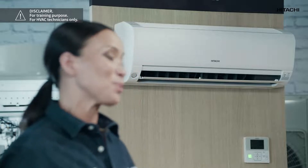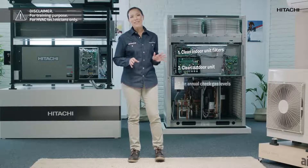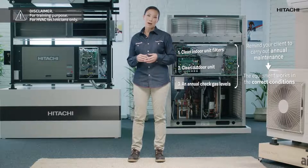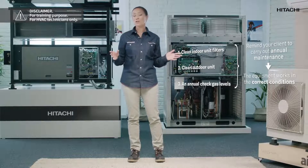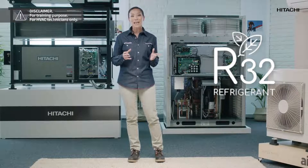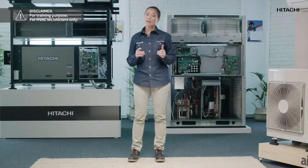Before we finish let me remind you that the maintenance of R32 equipment is very important. It doesn't differ much from what was required before. It is necessary to periodically clean the indoor unit filters to remove impurities and optimize performance. To do this we will open the device and remove the filters, which can be cleaned with a damp cloth and easily put back in place. The outdoor unit should be cleaned with compressed air or brushed by a professional. The annual check of gas levels should be carried out to rule out possible leaks. An advantage of R32 gas is that it allows refilling directly into the unit. As it is a pure gas there is no risk of altering its proportionality, as there was with R410A, which is a gas of mixed composition.